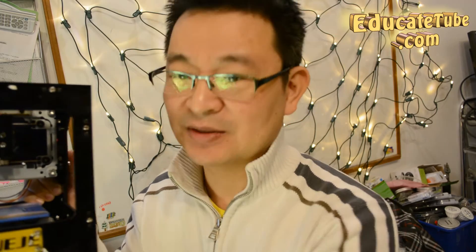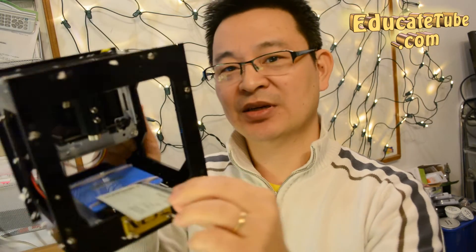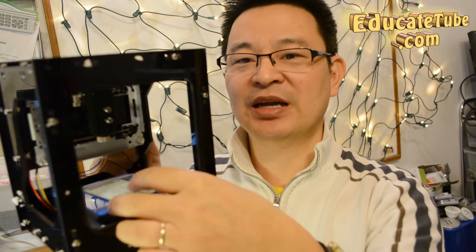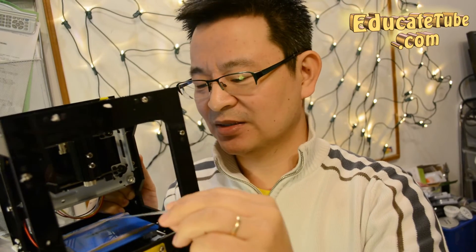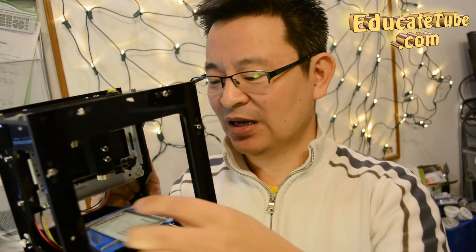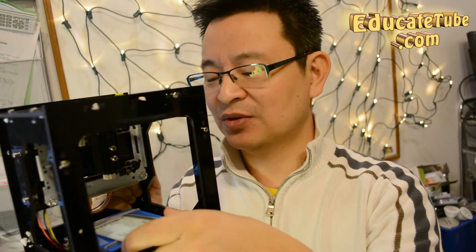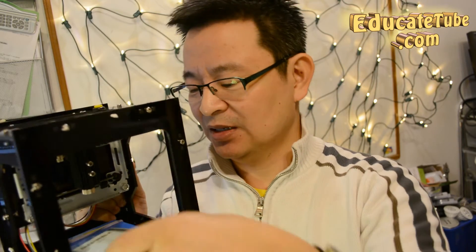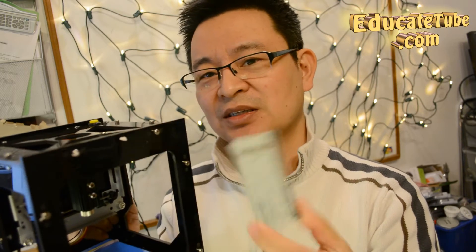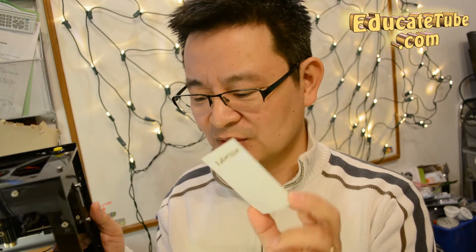Basically what I did was once I make a standard template for my business card, I put it onto this laser engraver. So I would place my business card — the standard business card — once it's already printed with your address and your name, you put it onto the laser engraver, and then whatever you want engraved — the symbol, the name — you put it on the platform and engrave it. It takes about three to five minutes for this kind of name. I have about six characters, and it's about a font size of 16 to 18, and it will engrave into this business card.